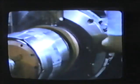In the initial stage of radial tire assembly, beads are the first components that are put into place on the tire building machine. At each end of the building drum on which the radial tire will be assembled, the beads are what holds the tire on the wheel. The operator then applies a non-reinforced layer of a synthetic rubber having very low permeability to air. This pure gum layer will form the inner liner of the finished tire.